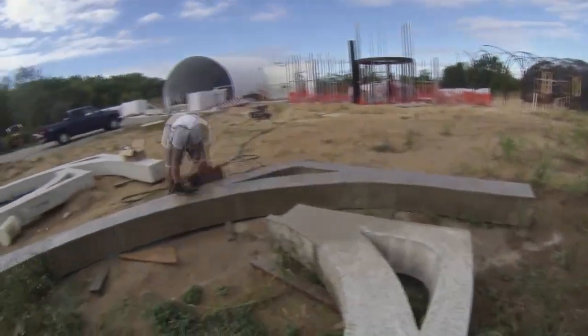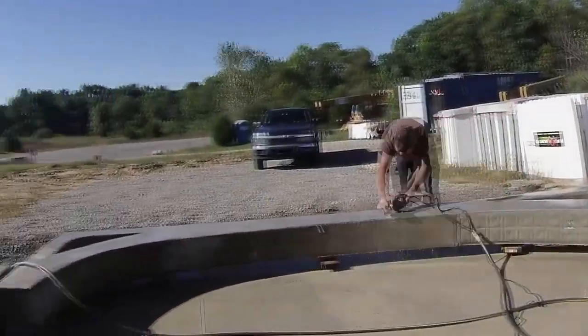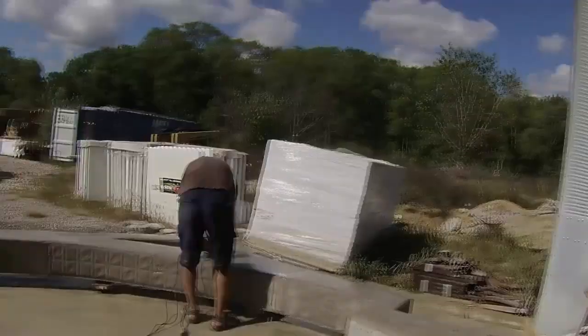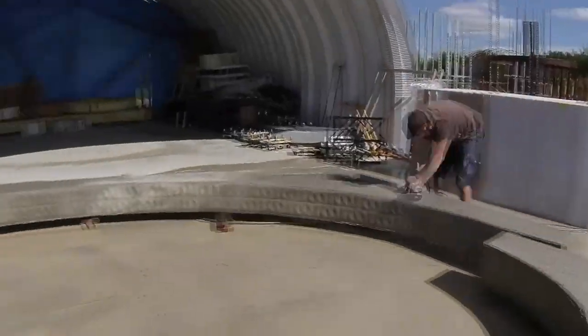That board in front of me is to keep the concrete from coating my ankles. This time, I polished the ribs that were still sitting on the slab. It was taking me several hours per rib for the first side. I did multiple passes, first with a diamond cup wheel, and then with successively finer diamond polishing pads — 50 grit, 100 grit, 200 grit. I also had a special round corner bit.